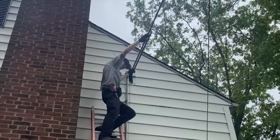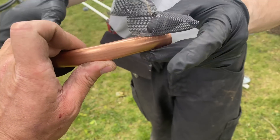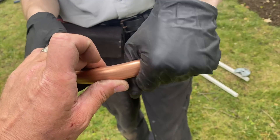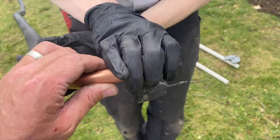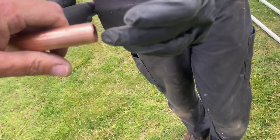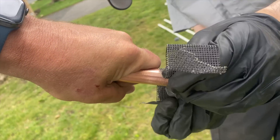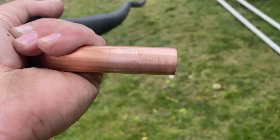We're going to use the zoom lock to couple them together. Here's our end of our three-quarter ACR refrigeration tubing. We're cleaning the end of the piping because we're preparing to use a zoom lock reducing coupling. Daniel's got a piece of emery paper — scratchy paper — and we have the pipe slightly pitched down a little bit. Now he's got his deburring tool and we are going to deburr the inside of this pipe.